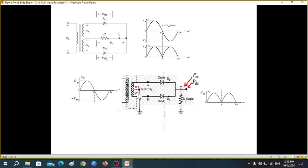The voltages in the top half and bottom half will both be called V_s, the secondary voltage, and each will have the same peak V_m maximum. If we draw a dividing line after the diode, the circuit is split into two parts: up to there we have the AC signal, and after the diode we have pulsating DC. The secondary voltage V_s RMS equals V_m divided by √2, the standard RMS formula.